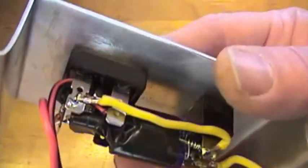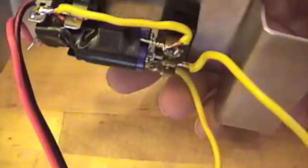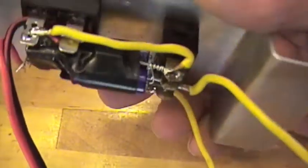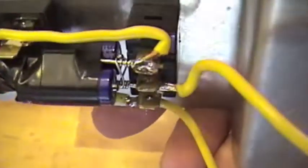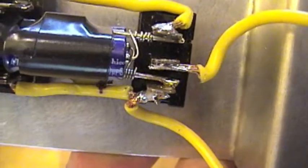This is just a little stop/run switch. Underneath is the bridge rectifier — it's 35 amp. There's also a little boost circuit in here: two capacitors and four diodes. At low RPM it'll give nice high spikes so you can get a little milliamp charging. The diodes are rated for 3 amps, so it's definitely overrated for what it's going to do. By the time the actual voltage gets up to charge voltage, it's bypassed and just runs through the bridge rectifier. That's how the kill switch is wired — center off, one side stops the turbine, the other is run.